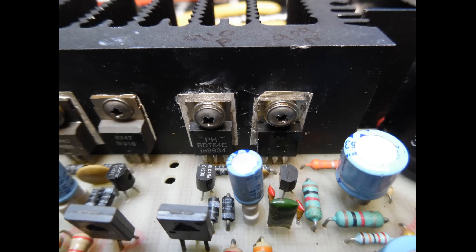Here you can see the transistors that were short circuit — different brands for some reason — and the single blown power supply fuse. Not a complicated repair, though it takes a moment to spot. For someone who repairs these regularly, the wrongly positioned transistors are immediately obvious. When you put these amplifiers on test with speakers connected, the sound is very impressive. I really appreciate you stopping by. For any support or guidance, email audioamplifierservicing@aol.com. Until next time, cheers and bye.